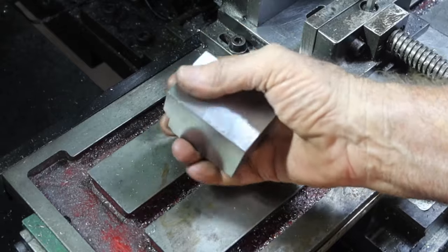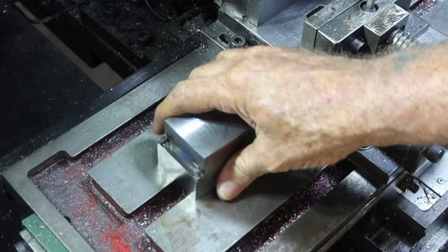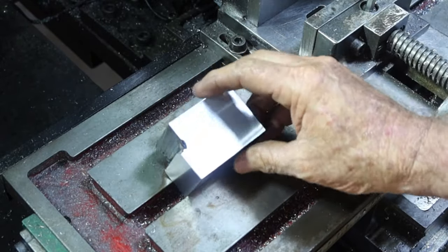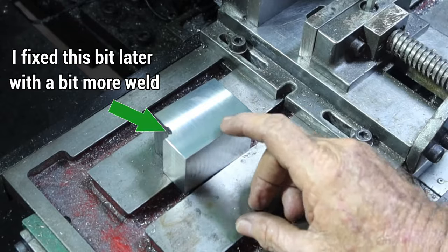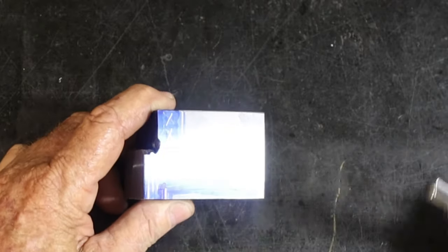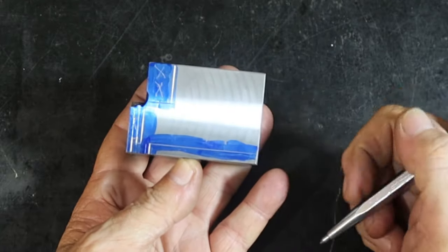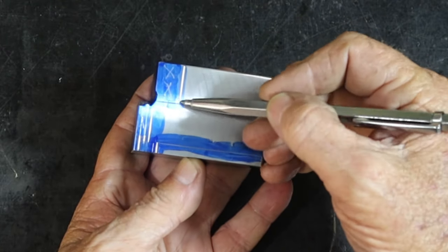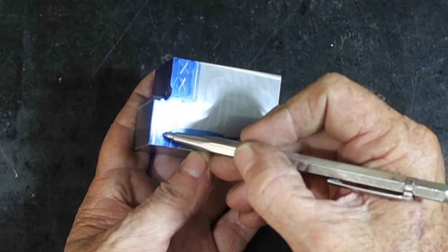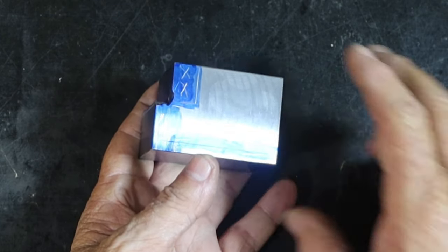The fly cutter continues to give beautiful finishes. I'm going to duck down the road and get my daily iced coffee, and when I come back I'll draw some pretty blue lines on this thing and give you a better idea of just what I want to do with it. So all of this bit here has to go, and this bit in here has to go, and in there there will be a two millimeter wide slot where the tool will fit.